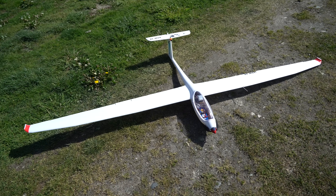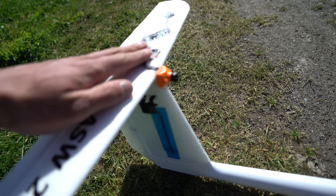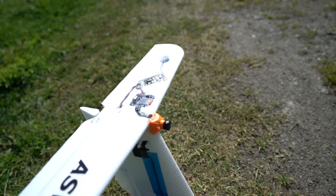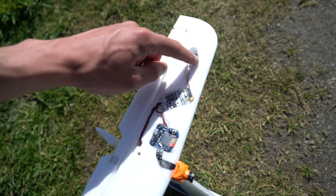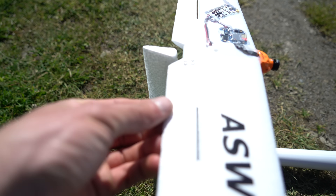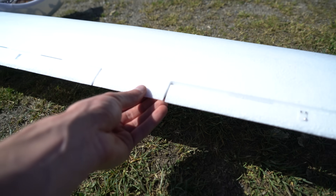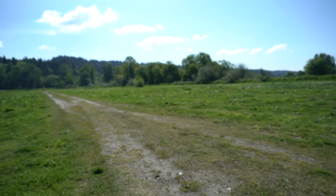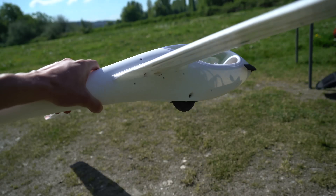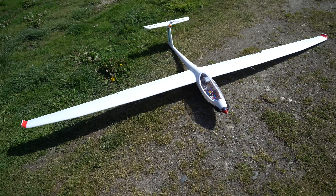So I bought a new one and built this one up to be even more efficient and better for soaring. All these FPV electronics up here are embedded into the foam, so they're all zero drag, low profile. I've got a 5.8 gigahertz 500 or 800 milliwatt transmitter with a little CP antenna and a RunCam Split there on the tail. I beveled all the trailing edges — as the plane comes stock the trailing edges are just square — so I made all that nice and sharp. I got rid of the flaps, just taped over all the seams.